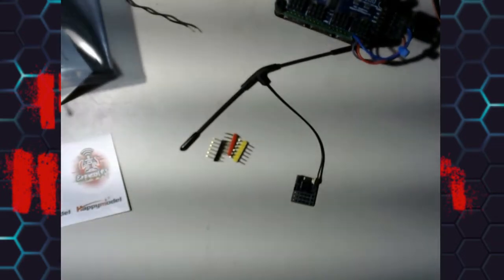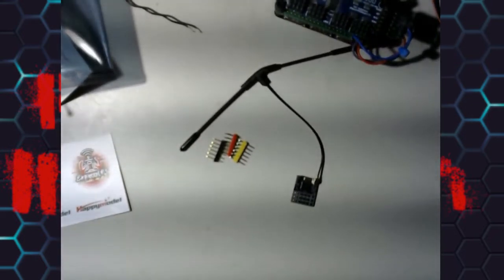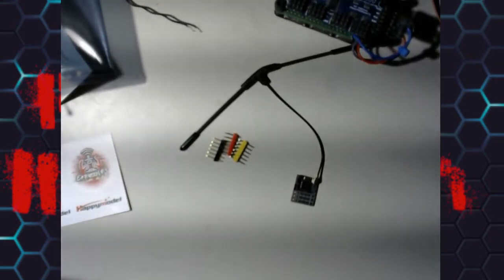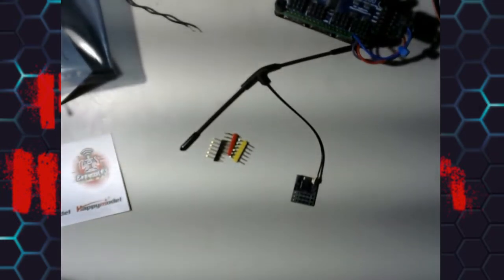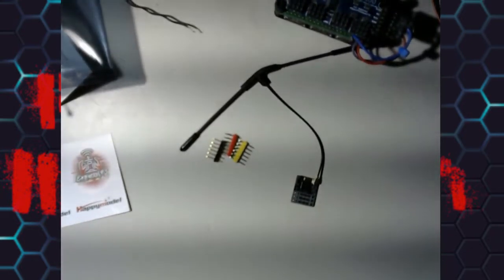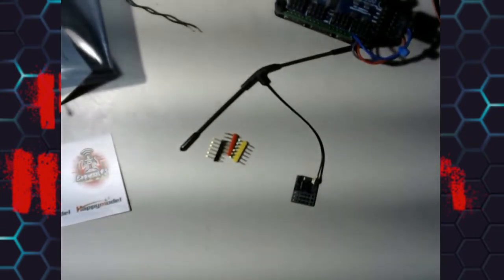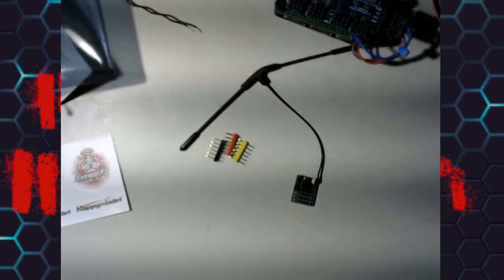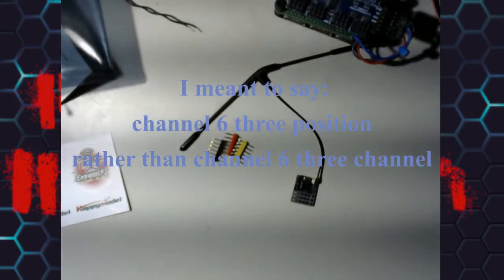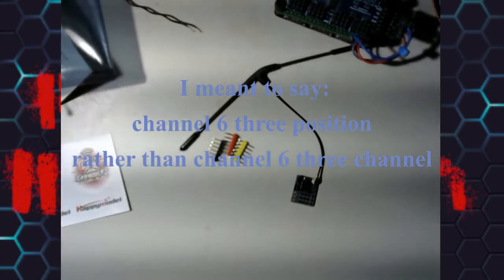So if you want to upgrade your Radio King, go to that one. But anyways, back to this receiver. This receiver is for flying wings, RC cars, or any more legacy style devices where you need pulse width modulation, 6 channels out to run it. The only thing about this is channel 5 seems to be an on or off channel. Channel 6 you can run a 3 position, and then the rest are variable. I've never tried to hook up a pot to channel 6, so I don't know if it's completely variable or just 3 position. But channel 2 is only 2 position, basically top or bottom.